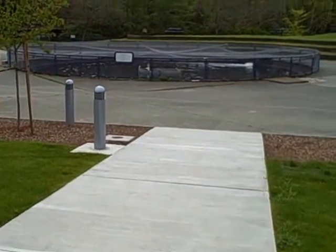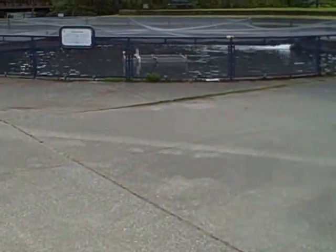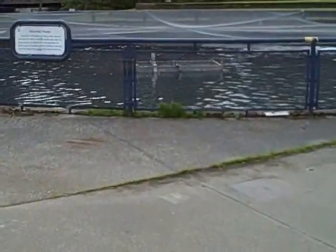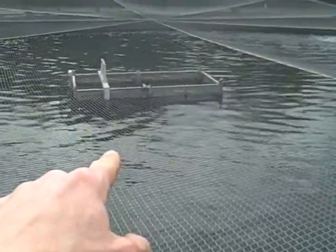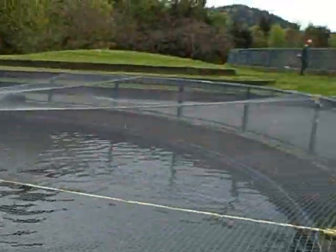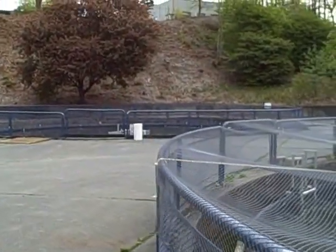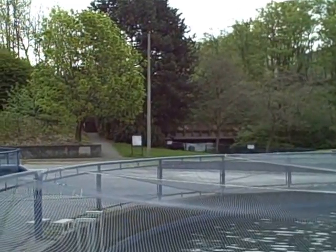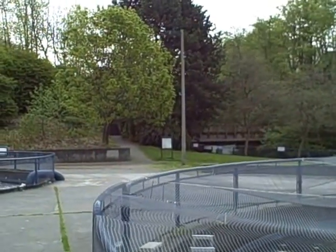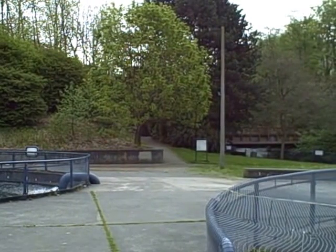These are Rosemount Model 648 transmitters — wireless HART protocol, battery-powered — and you can see one of them in the middle of the pond right here. On that metal structure we have a transmitter bolted to the side, using an RTD to measure the temperature of the water. We have another one in the middle of that big pond, which we call pond zero, and then another transmitter in the rearing pond. You can also see a concrete light pole right here with a transmitter mounted halfway up, measuring ambient air temperature. Further up, at the head of Watkin Creek where the hatchery gets its water, we have another transmitter measuring water temperature there.